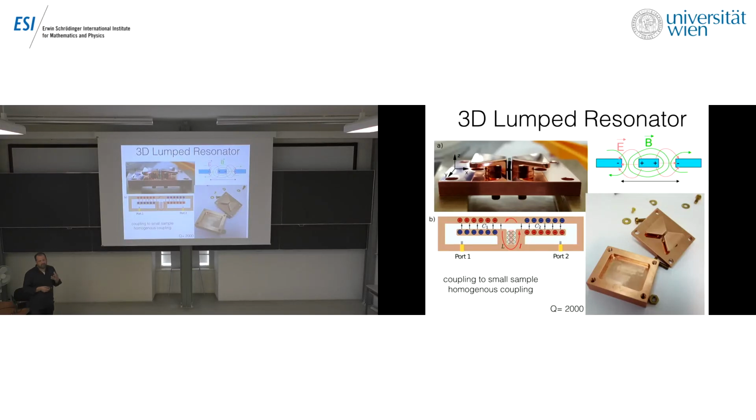So it's a super small inductor, but that's very fortunate for us, because in an LC resonator you always have to balance the two energies, and if you have a super small inductor, it means that the current that flows here is very large. And it creates a large magnetic field here in the gap of the structure. Another advantage is that the field that we create here, where we place the diamond, is extremely homogeneous, way more homogeneous than the field that changes here by orders of magnitude.